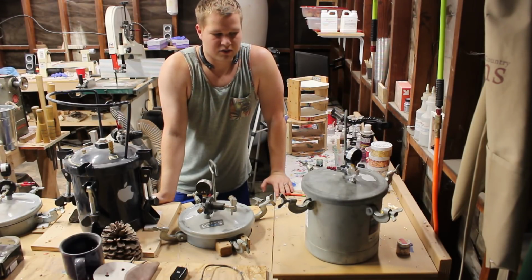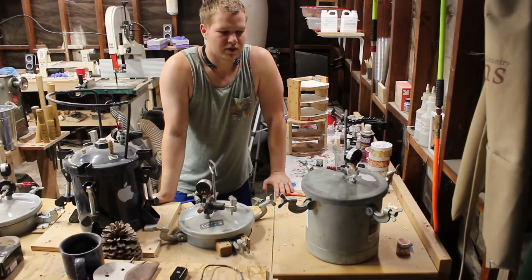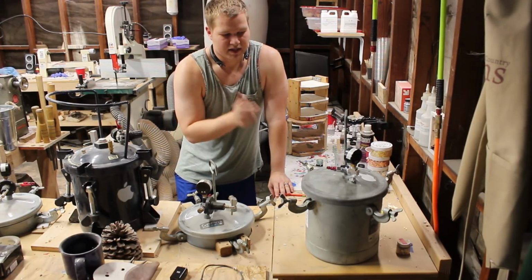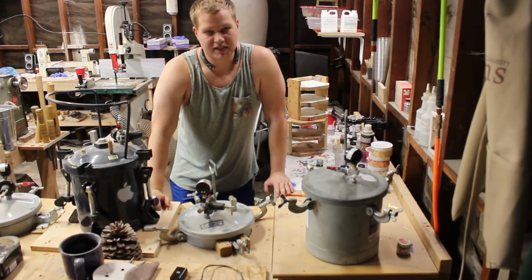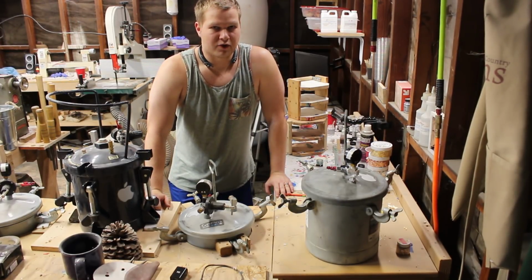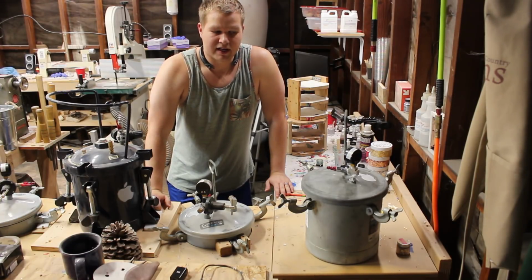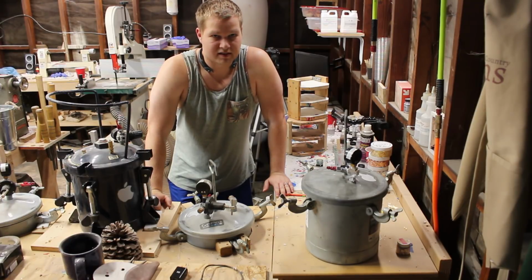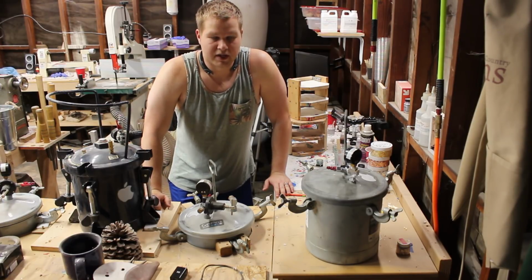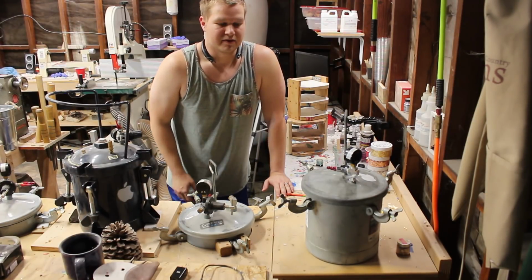I just really quickly wanted to finish what I was saying about it having a slight leak, because the threads weren't perfect. The max PSI on this is 80, and I fill it up to 70. After about 3.5 hours, which is as long as I keep my castings in the pot, it goes down to 50. That's fine with me, because my Harbor Freight's 50 is what I fill it up to. And even though those don't leak, if this leaks down to what they start as, it should be fine.